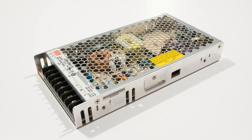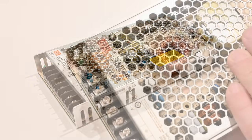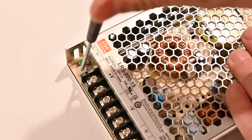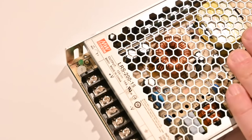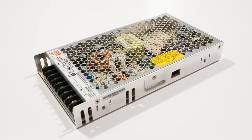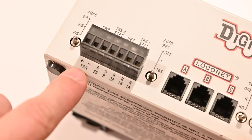It's a 14 amp power supply and it's rated at 15 volts DC, but the voltage is adjustable by a few points in either direction. And it can handle AC input of either 120 or 220 volts with a selectable switch. It's a perfect match for the DB220 booster. And as always, I'll provide a link in the description below where you can get these.